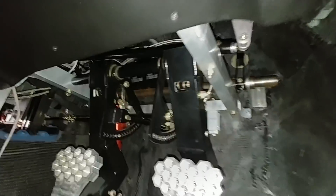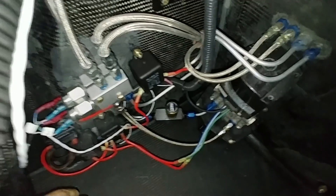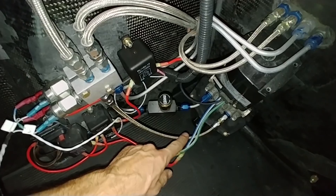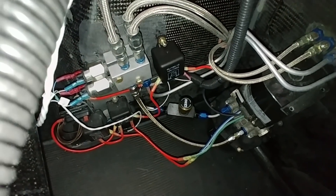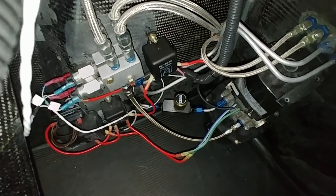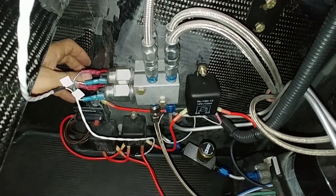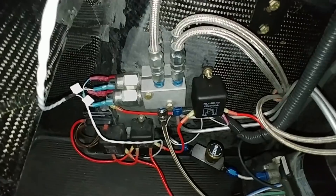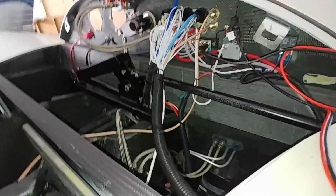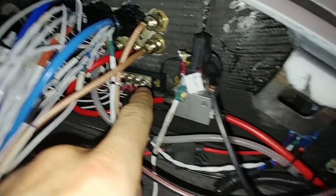With respect to the landing gear, I've removed the valve on the up cycle that was slowing it down and kept the other one. Because I removed that valve I had to put in a new hose — I didn't have the stuff to do a hard line, so I've just done a flex line in there. I also removed the power control I had; I really didn't need that once I had the valves in there — it was just creating another point of failure. That tidied things up a bit. I want to show you how I actually bypass that pressure switch.